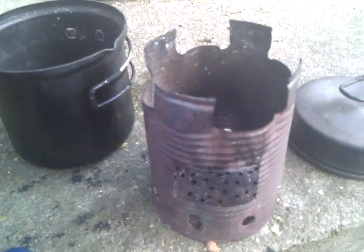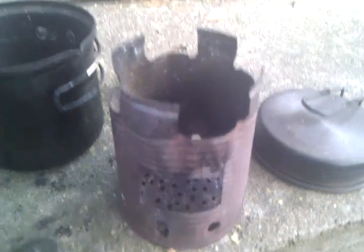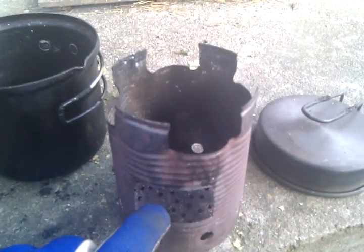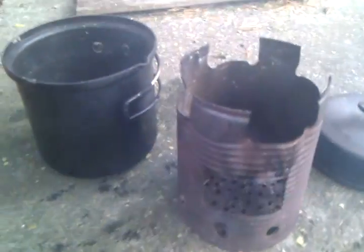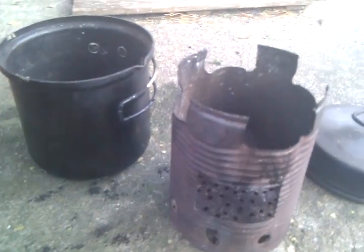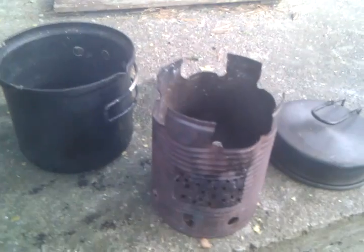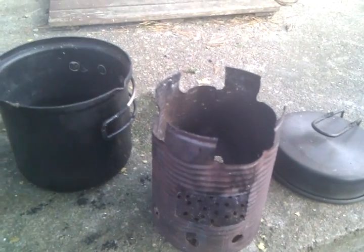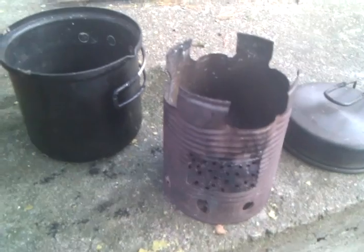When I first made it, I made it without this hole and it didn't work as well. I also made it without the air holes and it doesn't take in enough air, especially in the back — it won't burn if you only have one hole at the front. Since this is not insulated, it won't burn hot enough to make an efficient stove. I hope this was helpful. Please leave comments if you have ideas to make it better, or if you have similar versions, put up a video response. Thanks.